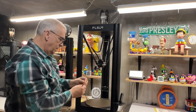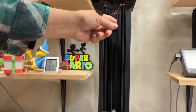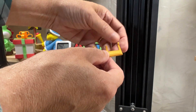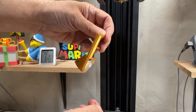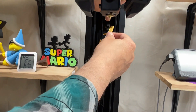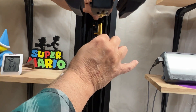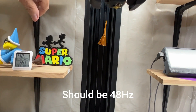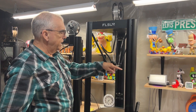Kylie, you're going to have to come in and do a close-up of this. You want to get approximately in the middle of the belt. You can see that two of the legs have little hooks and one does not — put the hookless one around the belt, put one in the front of the belt, then push the last one to the back of the belt. You can see that it's right in the middle — 57 Hertz.